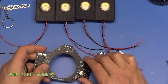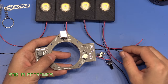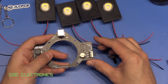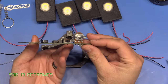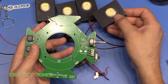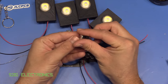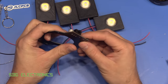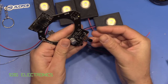The next part is to put in the through-hole parts that JLCPCB couldn't assemble. We've got the DC jack from Cliff Components, which fits in nicely, and the slide switch - same as before. I did end up changing the potentiometer. The old one was quite bulky and kept getting in the way of the mounts and added quite a lot of height to the PCB - it was the tallest component by a long way. This new one is actually the other part I had in the original video - I selected two potentiometers but only placed one. And there we go, it's in there nicely - not much higher than the electrolytic capacitor.